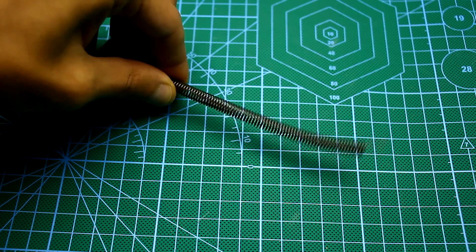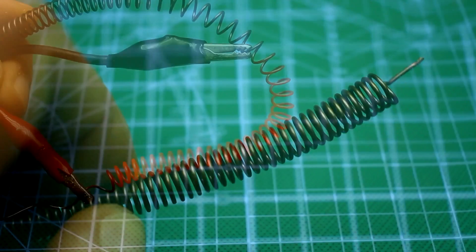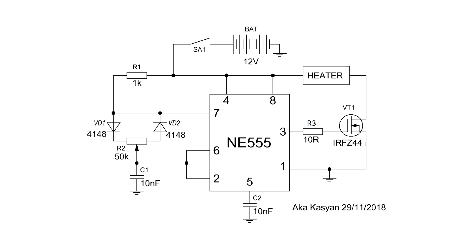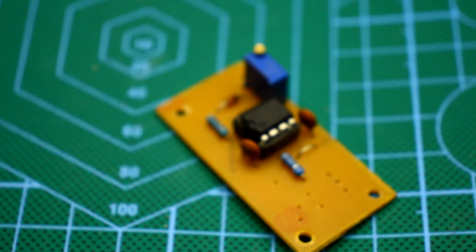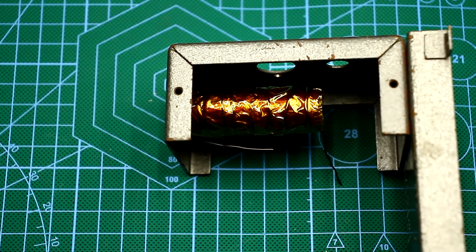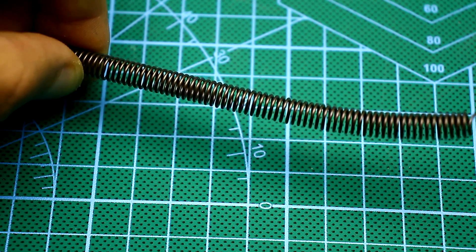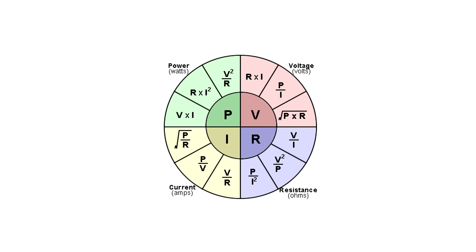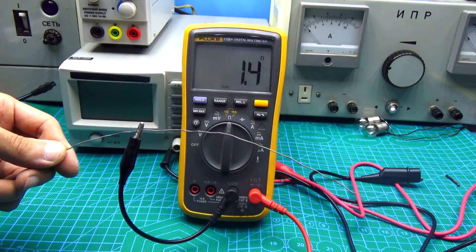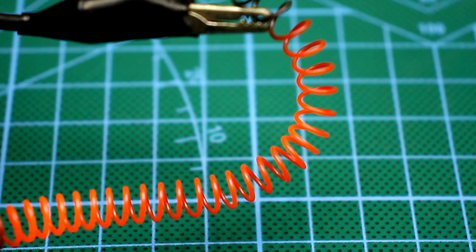The heating element will be made of nichrome spiral as the most affordable option. I plan to make a 100-watt heater, which for such a bath is not a lot, but I will supplement it with a PWM power regulator — adjusting the power essentially adjusts the temperature. First we need to understand what resistance the heater spiral should be. Ohm's law will help: we know the supply voltage is 12 volts and the approximate power is 100 watts. From this we can calculate the resistance of the heating element — in my case about 1.44 ohms, rounded to 1.4. The actual results will slightly deviate from ideal because the resistance of the heater changes when heated, but these deviations are not significant.